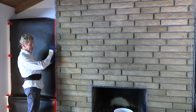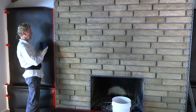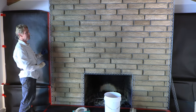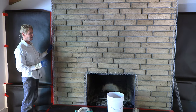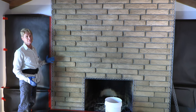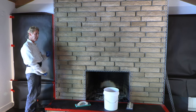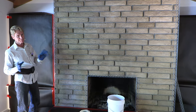Then we put some corners on. You have to think about how thick or how tight you want to put these corners. They said they want a base coat and then a lime finish — a plaster lime finish. We're going to do the lime finish after the base coat. I'm not sure how long the base coat will take because it's wintertime and the materials are old. We're going to experiment to find the right accelerator for any plaster.